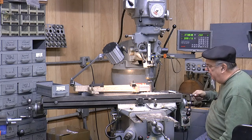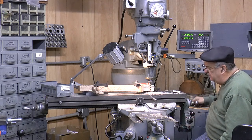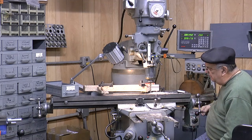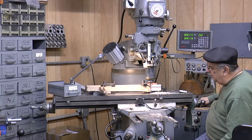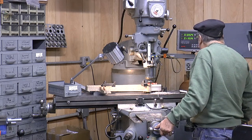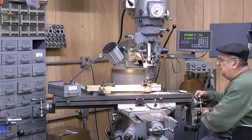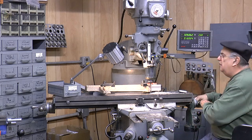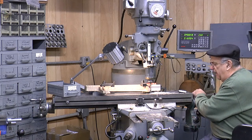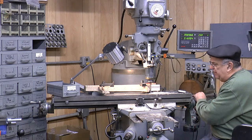You can go a little bit faster on the second cut. Still cutting. Move another thirty — you want twenty. I hear it's starting to squeal, which means it's taking more. I'm an eighth of an inch away from the line. There's a lot of material on this. I'd rather have more than not enough. I might go to a five-eighths end mill if I have a long one. This is only about a little bit less than two inches.